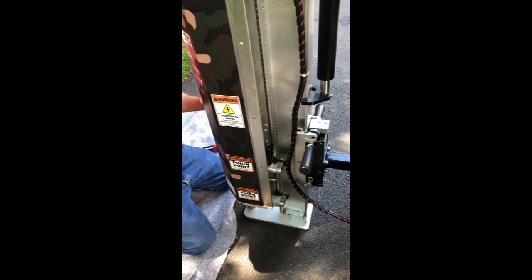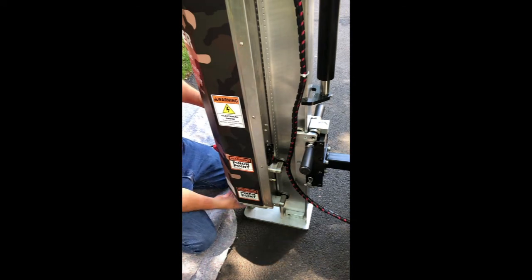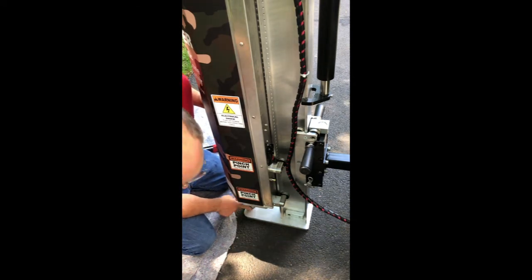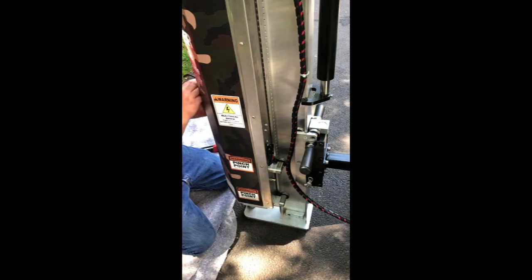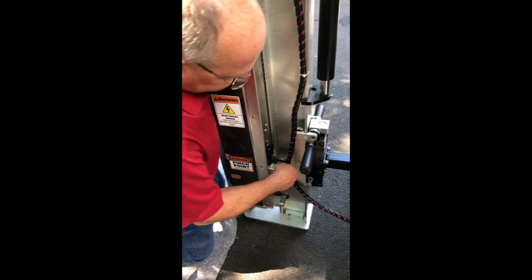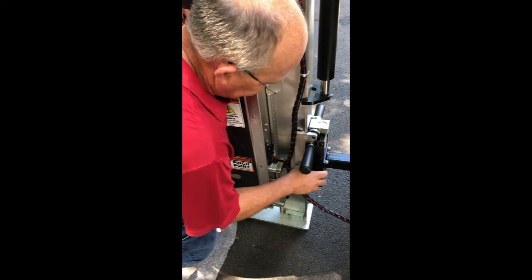The reason you want the sapper at the bottom with the hammer in the locked position is that it will rest on the anvil on the foot when the rollers come off. So you don't have to carry the full weight — you just have to keep the unit from falling away from the beam when the rollers come loose.